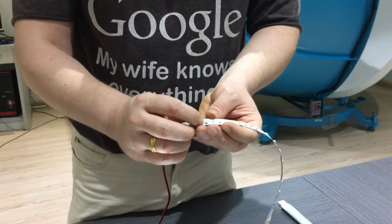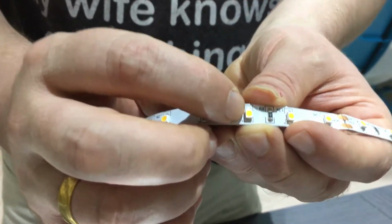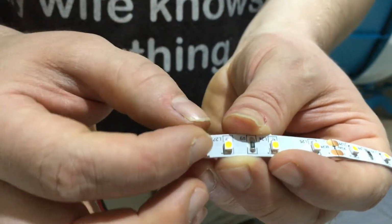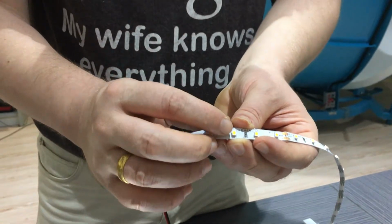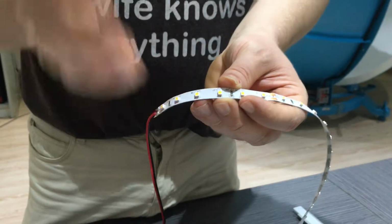Obviously more expensive. We then use a very high quality epoxy mix on this. The material we put in the epoxy on the diode will help to stop it from discoloring. Discoloring is a big issue on low grade diodes. We use a high mil diode, that means a big size of diode. We actually use 29x7 mil diode on this version, which we package ourselves.